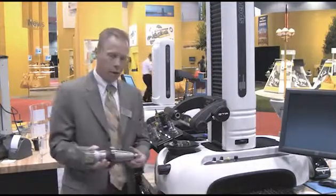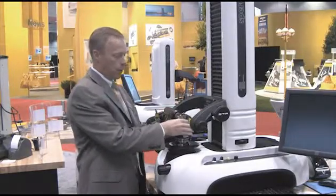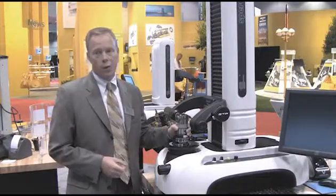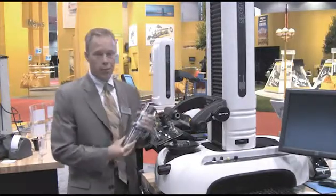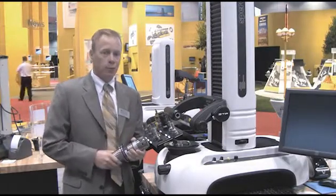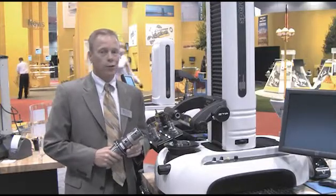The tools, with retention knobs installed, can be placed into the machine and via the clamping system clamped into the spindle with a force of about 450 pounds. This clamping force is going to improve the repeatability from each operator to be exactly the same setting measurement, thereby increasing the repeatability of the overall pre-setting operations.